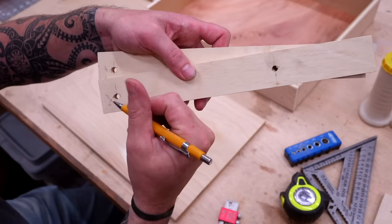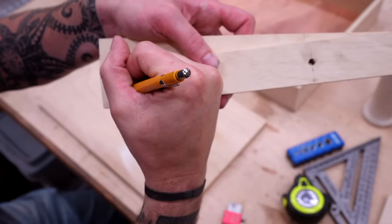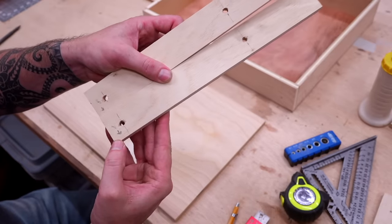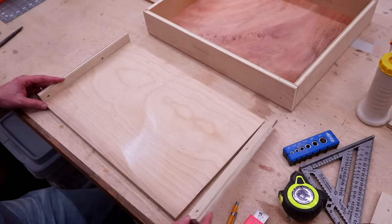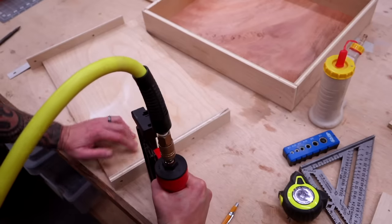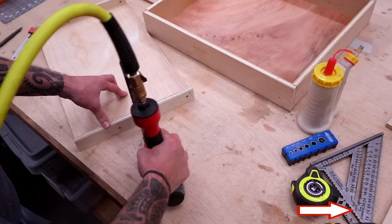Before switching our boards around — this is the back, we have our 'B' here, and this is five-eighths of an inch from this edge. I'm going to draw an arrow pointing towards the five-eighths edge; this will help us in the next step. With our arrows facing up, we're going to attach these two boards to the sides of the 19-inch board, using wood glue and brad nails, the same way I did for the bottom. And if you like these types of videos and think I've earned a subscribe, make sure to hit the little icon of my logo in the right-hand corner.